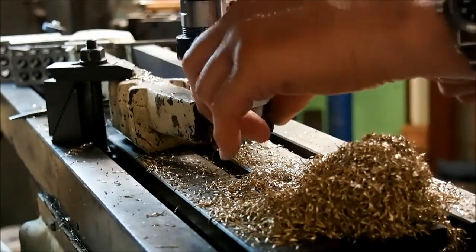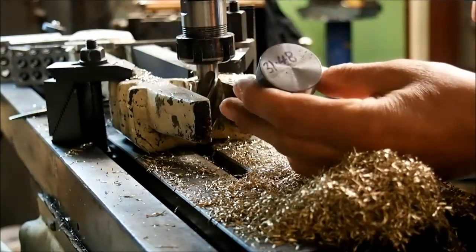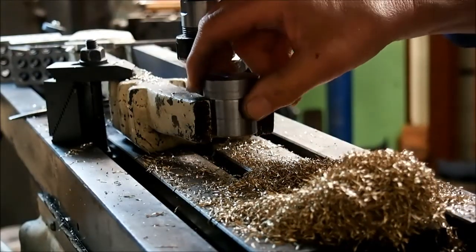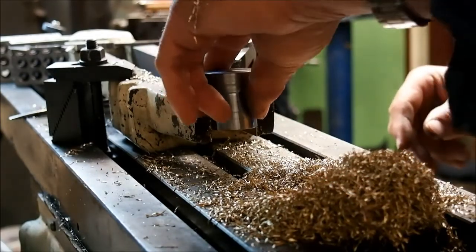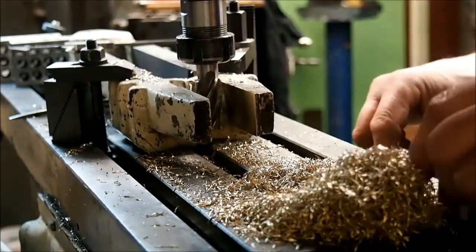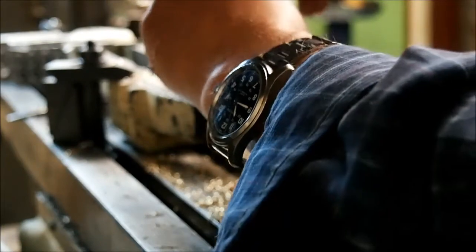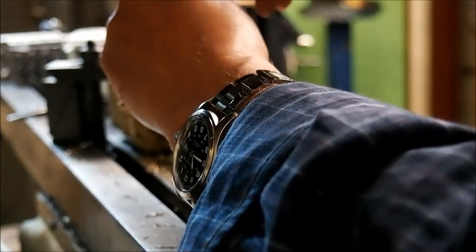We're pretty close, but not quite. We've got our gauge here, which is 31.48. It almost wants to go, but not quite. It's quite awkward measuring a parallel surface — it's not like measuring a bore because the gauge wants to slip in the wrong direction.